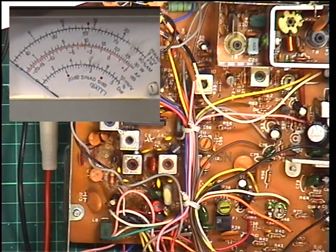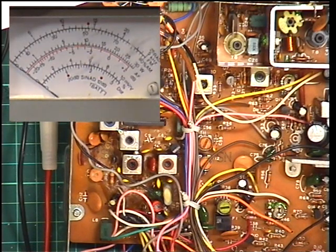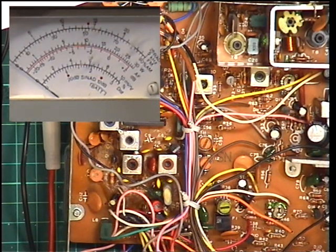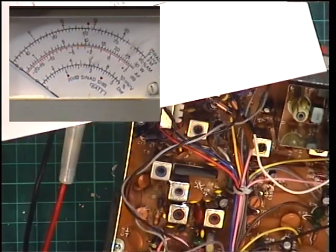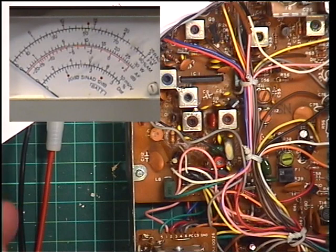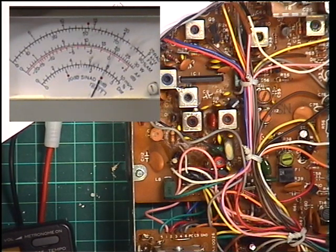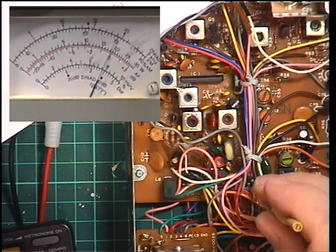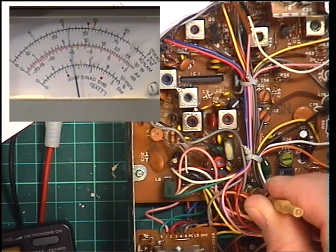And next we'll do the deviation. I'm deliberately avoiding doing the frequency one, so that I can just move the camera over to the frequency counter on this instrument. So we're going to deviation. I'm going to have to just adjust this. So moving over to deviation, I suspect VR1 to be deviation. And VR1 is that one down there. That's what I suspect. I'll get the oscillator out. Oh dear, it's 3.5, far too high. So just that for about 2.2.